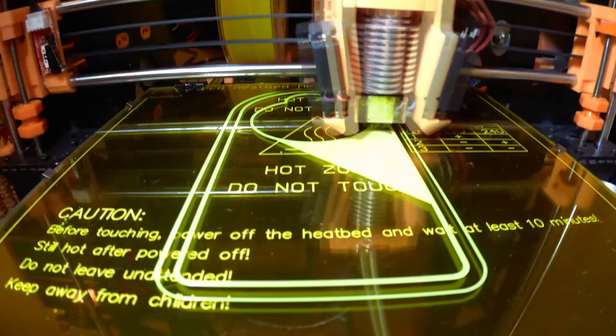I did take advantage of my printer's new firmware from Marlin, which has the M600 pause/change filament command. What I was able to do was print so far up with yellow, then issue the M600 command, which allows you to change the filament — change it to black — and the black was then printed where the sign lettering goes.